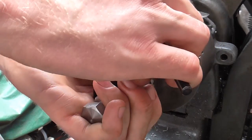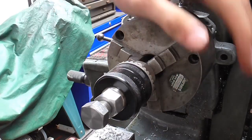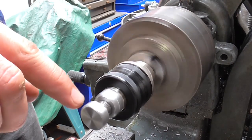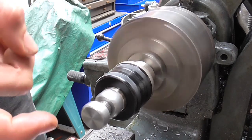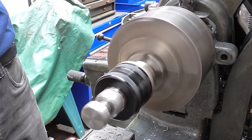All that remains now is just to lock this up. I spin this up — you can see the bolts are a bit eccentric — but the chuck body is pretty good, and none of that actually matters because I know that the hole that's going to go in will end up concentric to the jaws, which is what matters.